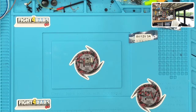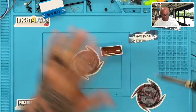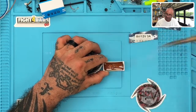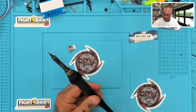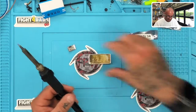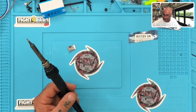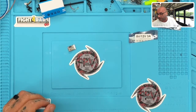Let me grab one here — these are the hard rosin that I've told you guys about, that I use when I solder. This is what you put the soldering tip into to clean it. Watch — here's the tip right now, still somewhat clean. I just let it go in there quickly, take it over to the little metal sponge, and I get a nice clean tip. I would definitely recommend you guys pick these up. They're cheap but they do a great job keeping the soldering iron clean.